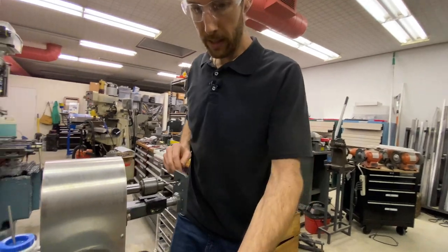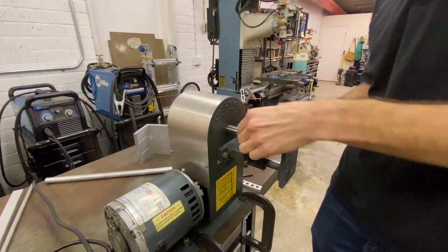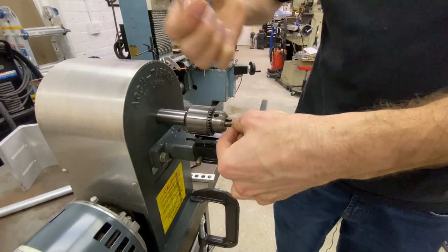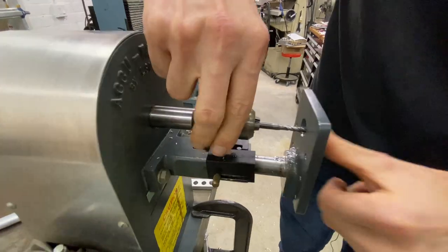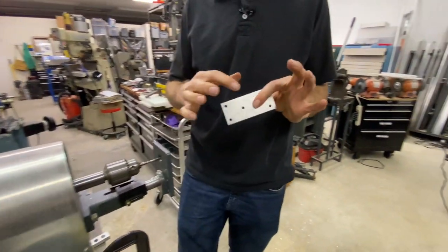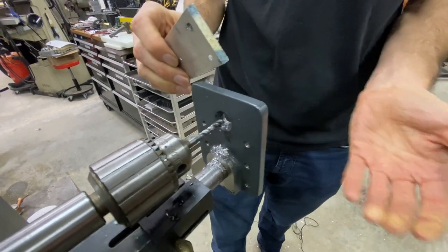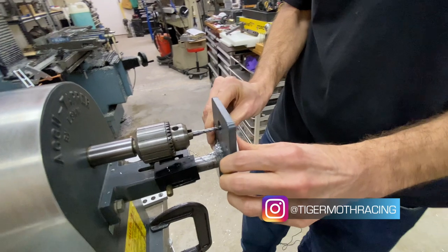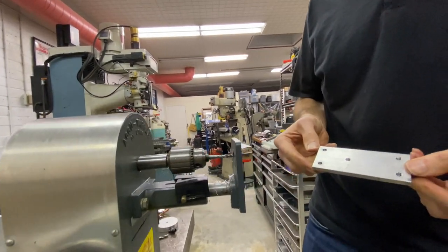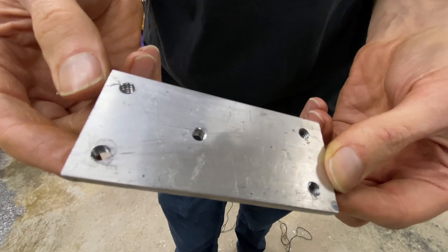Let's take a plate here — I have a couple extra pieces. I'll show you the tapping action, but I'm going to turn it off before we do that. One of the safety concerns is you have to remember that anytime you put any pressure in either direction on that spindle it's going to turn, so changing the chuck with the motor running is dangerous. Always turn it off when changing tooling. Turn it back on, add some tap magic — we have pre-drilled holes here, this is 1/4-20, about a 200-thou hole. You just push against the tap and pull away and it reverses. You can see how quickly this works by hand rather than doing it in an NC mill — these machines are intended for shops that maybe don't have rigid tapping or peck tapping capability.